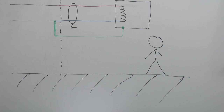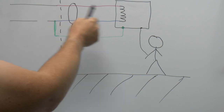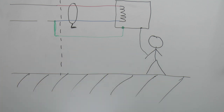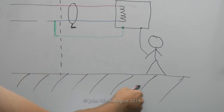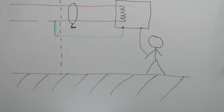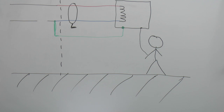That's initially going to be the full mains voltage of 230 volts. If a person is unfortunate enough to come into contact with the metal casing, they're going to get a severe electric shock, because there's no return path for the current. But as soon as somebody touches the metal case — and this could be any of the items connected to the system — they effectively form the return path: current flows via the line wire, through the heating element, returning via the neutral, onto the earth conductor, through the metal casing, through the person, back to the ground and back to the transformer. The resistance here is going to be very small compared to the resistance of the person and the ground, so in most cases you're going to get pretty much the full mains voltage — quite capable of killing people.